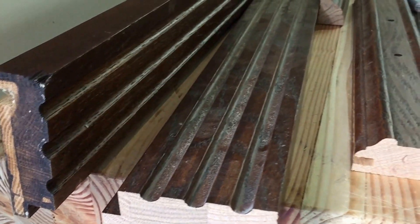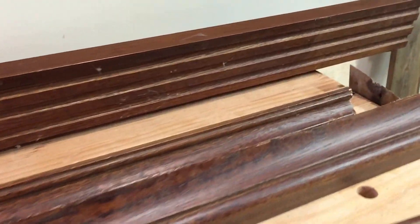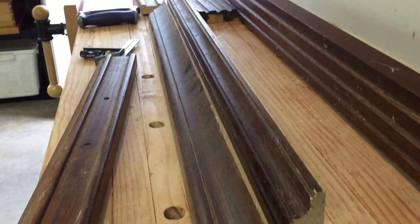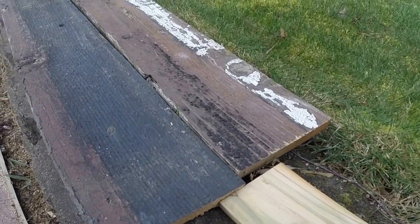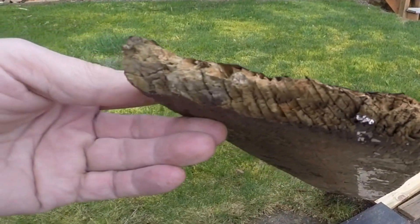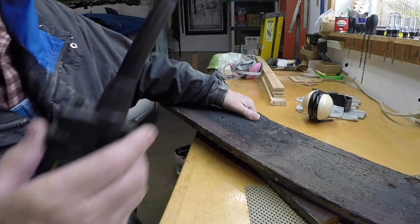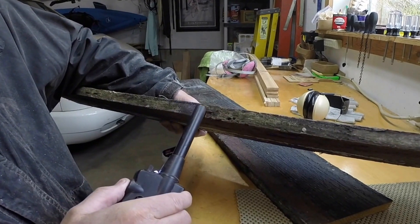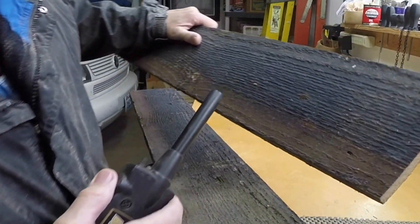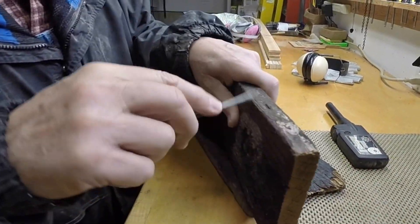What you're looking at here is a few of the remaining pieces of an oak armoire that we cut up at Teresa's dad's house. Before we get started on the saw, we have to look out for things like staples and nails. Those are gonna be no fun on your saw, and no fun on your planer for sure.